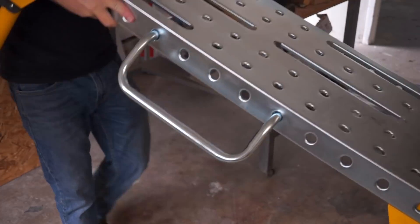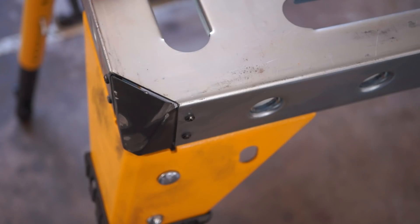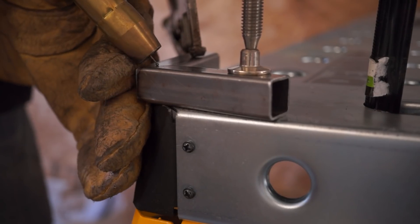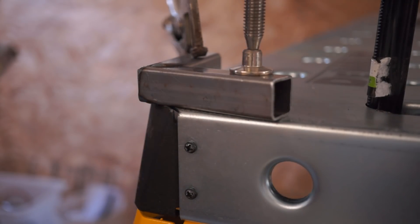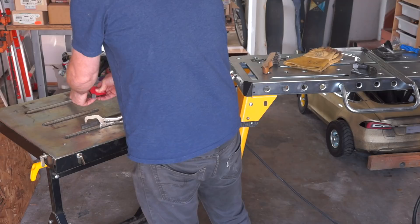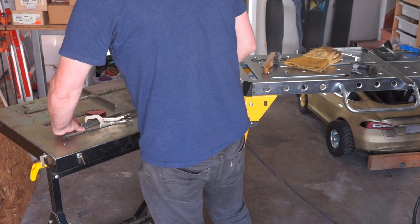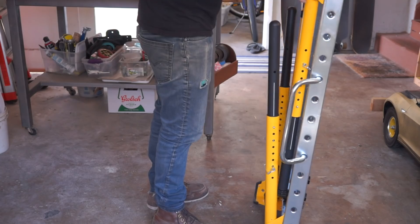This table doesn't have corners anyway — they're all punched in. Why would you do this? I suspect it's because if you're welding a right-angle connection that meets up at the corner, this design lets you tack every side of it without flipping it over. Or if you do flip it, your first weld doesn't prevent the piece from sitting flush. So for me, those are all wins for the DeWalt, but for most of us still probably not enough to justify an extra $130 over the Harbor Freight.